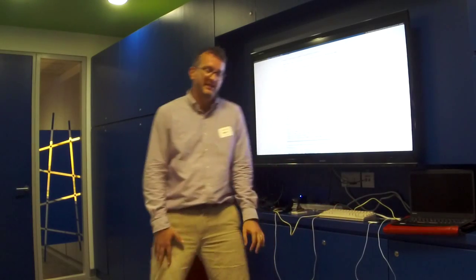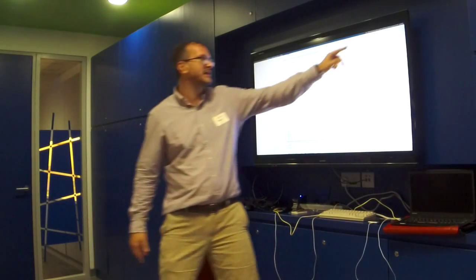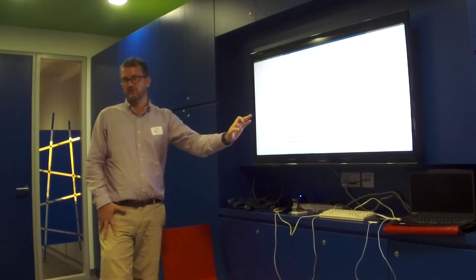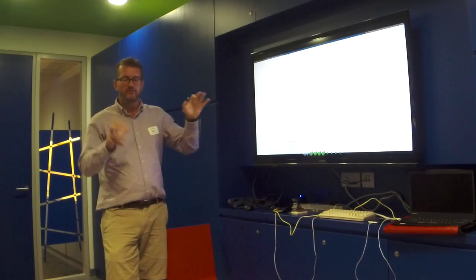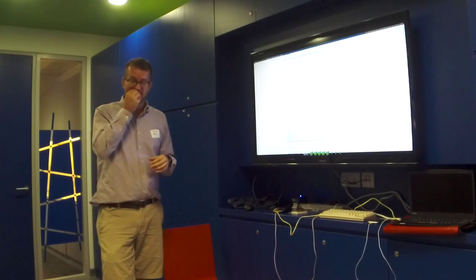To be honest, WebKit 2 on Raspberry Pi 2 is not great either, but at least you have like 1 gig of memory. This is actually the available memory count, so I can tell if there's a memory leak. The browser sort of works on the Raspberry Pi 2. This is why I've aimed it at digital signage, so non-interactive usage. If you expect to use it like your laptop, you're going to be sadly disappointed.